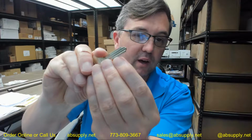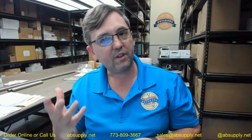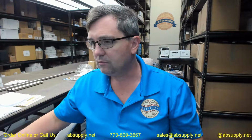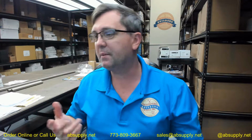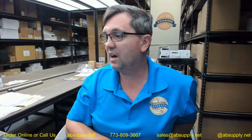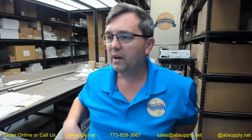Okay. Now, one can study those notches on the key blank to derive the keyway. The purpose of this video is not to derive those different keyways, because I don't have examples of all the keys here. But that's where the number comes from. So this is what a 1368 looks like. You could very easily have a four-digit number that will give you many different keyways. 1368 is common. 1467 we bump into occasionally. 1347 we bump into occasionally. And it looks like there are probably another 30 or so numbered keyways.